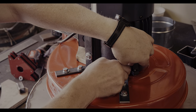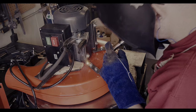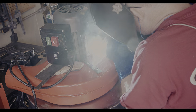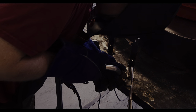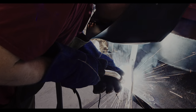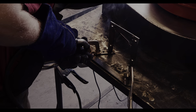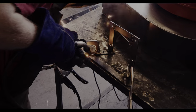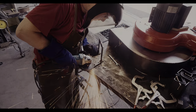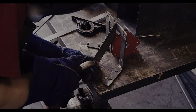Oh well. As I don't want to damage the finish on the blower housing, I am just placing a couple of tack welds before taking the frame off and welding it together properly. The cross brace from angle iron is hopefully strong enough to stay upright under the weight of the blower, which is surprisingly heavy. That said, as the impeller is made from steel, perhaps it is not so surprising after all.